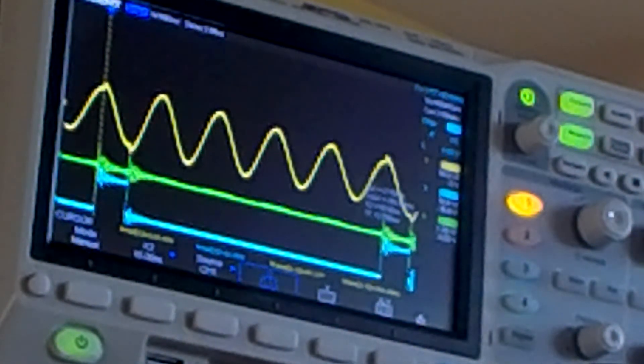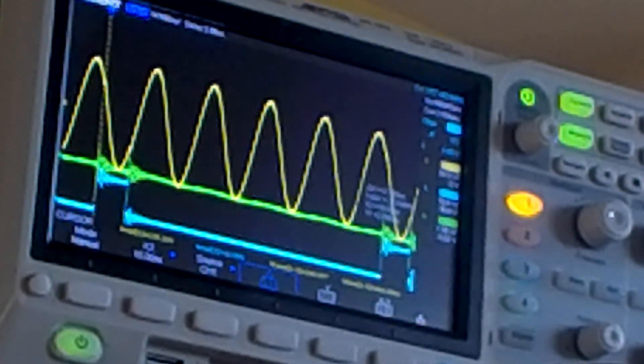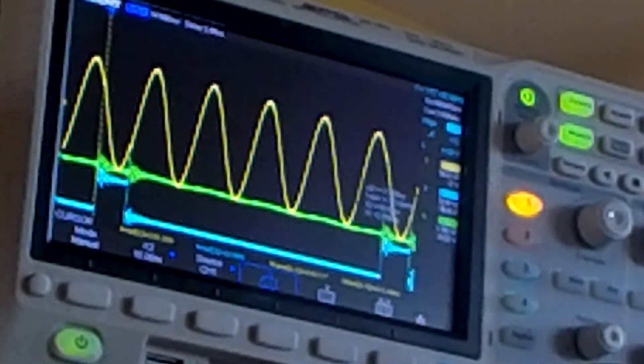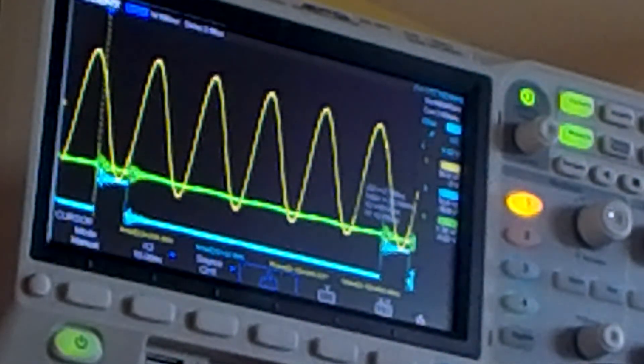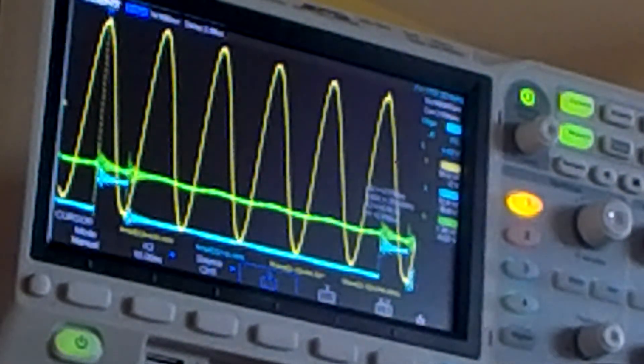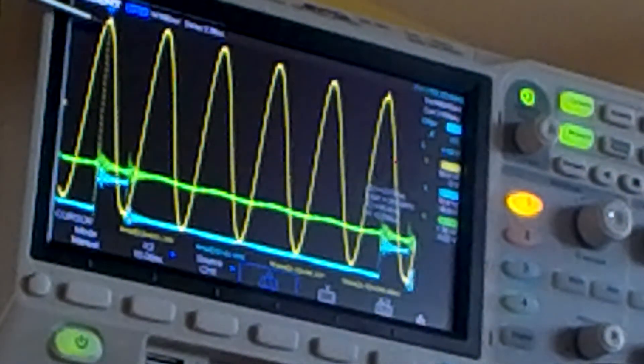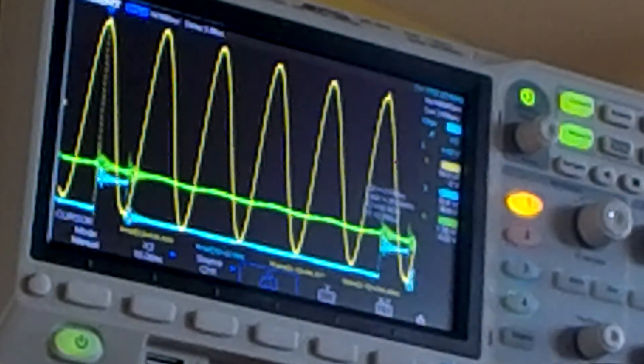Now you see that we are creating a phase shift when removing. So I'm going to place the receiver further away. You see a huge difference also on the voltage of our receiver, so I'm going up in frequency, and again at 178.2 kilohertz we are in the middle of that maximum value and we have the highest output.